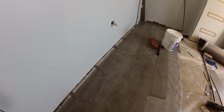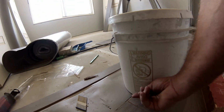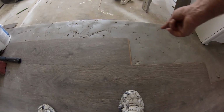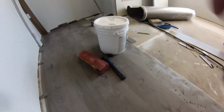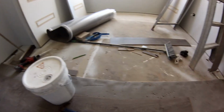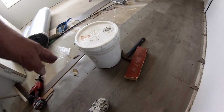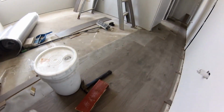I could push the others in and lock them properly. The other issue I had was the ends of the planks where they butt joint popping up. So when you walk up here to hammer the plank in, the end of the plank up there is lifting up. I couldn't be in two places at the one time. So I've ended up using a 15 litre tin of paint just to keep that pressed down so that when I hammer it in, I lock it down.